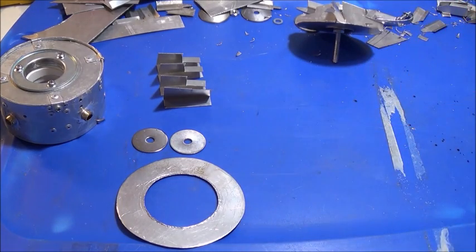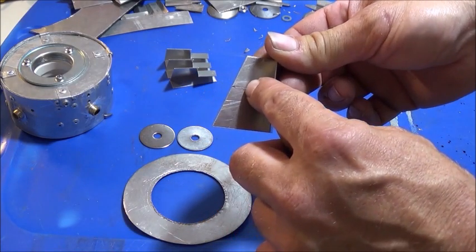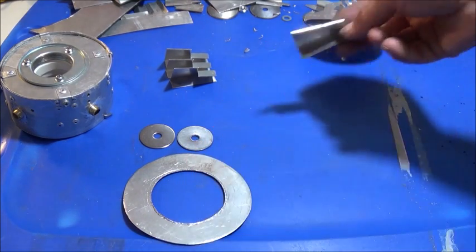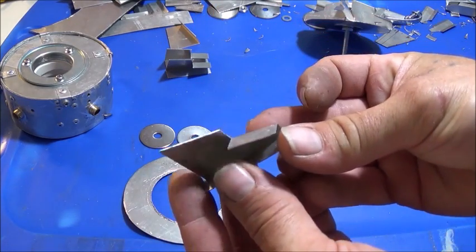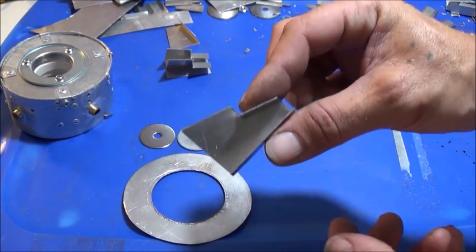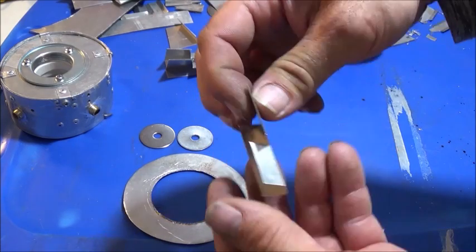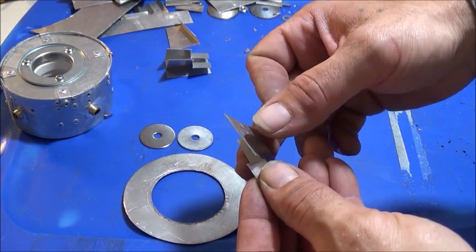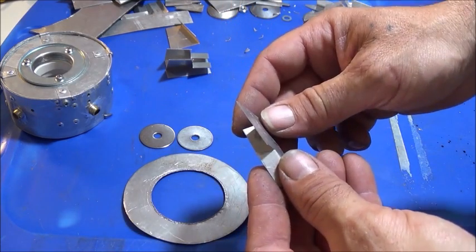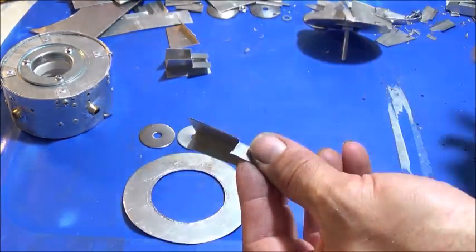Here's how we're going to build that compressor. It starts out as a simple flat piece — I fold a 57-degree angle, set up the line for the next break, and mark where I'm going to cut so I have a one-inch face plate when done. It ends up with a fold over on each side for mounting to the top and bottom plate. That's where compression takes place. The one-inch wide leaf comes up from the center drive rod, and I'll curve all of them a bit with pliers to scoop air right, mimicking the curvature on the face of the blades.